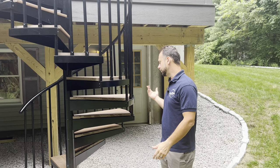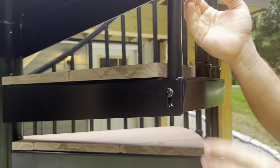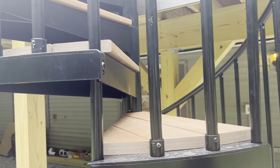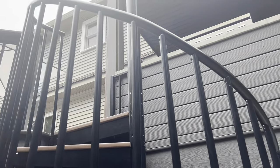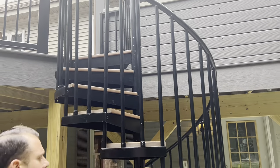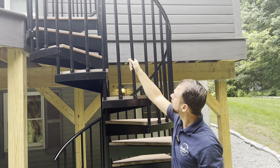The next step in the process is putting your front balusters on. You can see there's a nut-and-bolt connection here, and they give you a little channel to make sure there's no slop. The angle on the railing is already pre-cut. It has a self-tapping screw at the top — we pre-drilled with a 1/8 inch bit because without that the screw was walking all over and we got some scratches on the railing kit. That would be my best advice on that step.